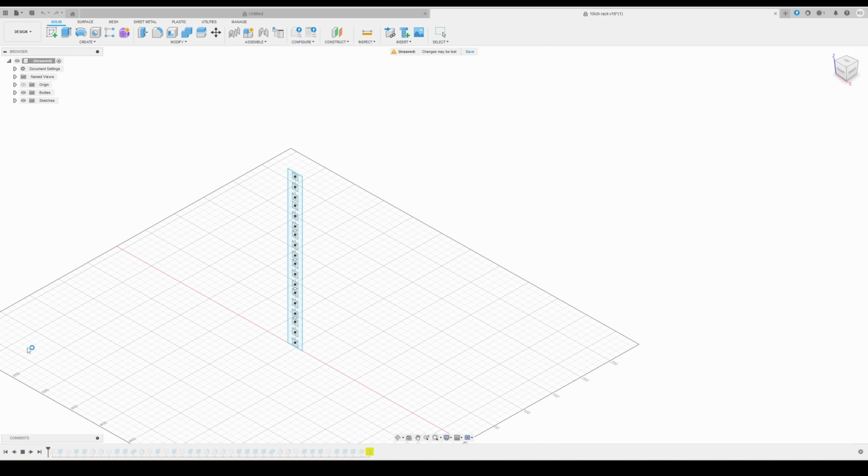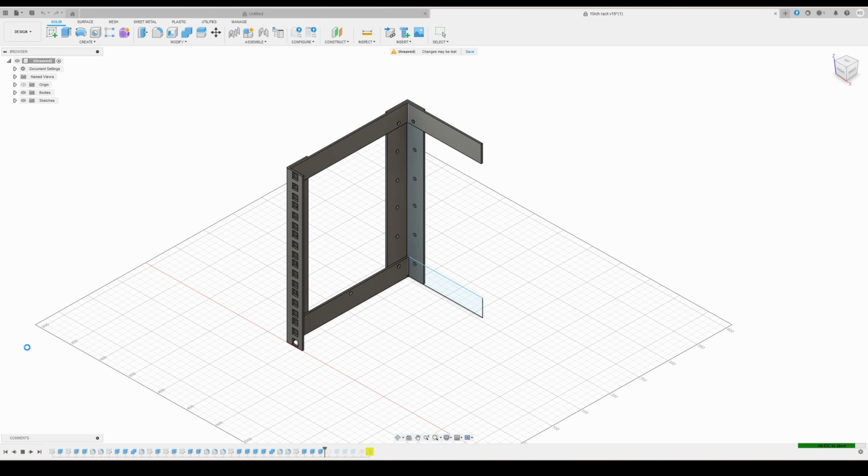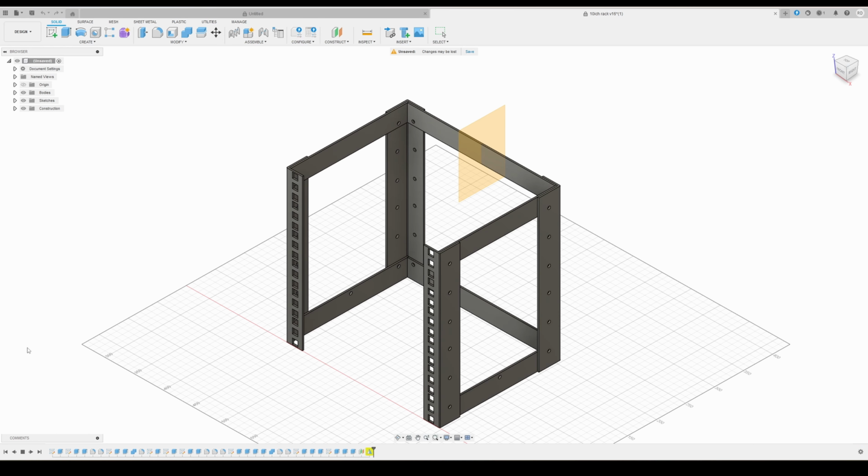Now onto the fun bit, designing our custom 6U 10-inch rack. In Fusion 360, I kept things compact and minimal, making sure it fits snugly inside the living room cabinet while still following the standard rack dimensions for proper mounting. It's designed to house the Apple TV, Philips Hue sync box, Hue Bridge, UniFi network switch, and a keystone patch panel. All neatly stacked.